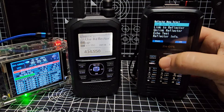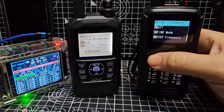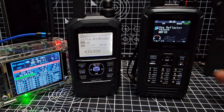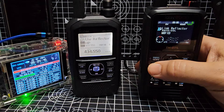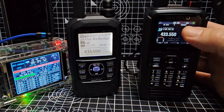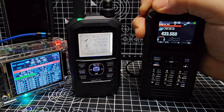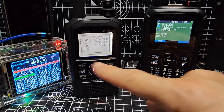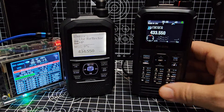For general chat you leave it on use reflector. I need to make sure we're actually in DR mode — let me go F. I've turned on data and terminal mode so let's turn that off — go to menu, gateway, turn that off, then come out of data mode by going F menu. Now it should let me TX. M0FXB test — and we're getting beeps back from the D-STAR system, but we're not opening up that hotspot. Thanks for watching my YouTube channel — the next one I'm going to have a look at the Digi-peater. 73 for now.